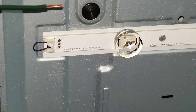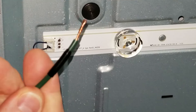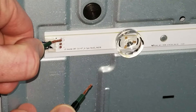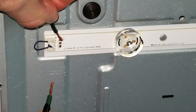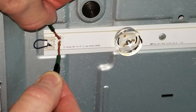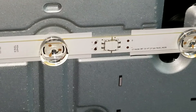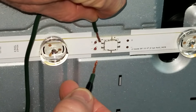Here are the contact points. Again, positive is up above and we're going to test it on the middle negative one. So we go ahead and put the positive on that one — remember this whole entire row is dim and I can only test it from the middle section. You just put your positive contact on that one and your negative on that one and the lights should light up. Test the middle one on these particular lights right there.